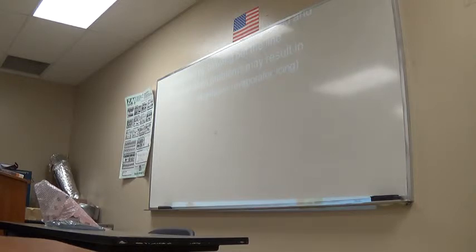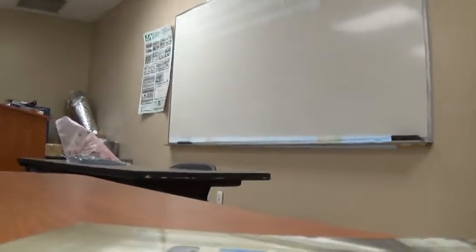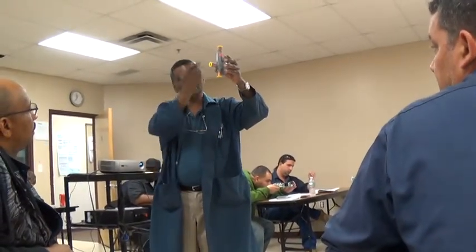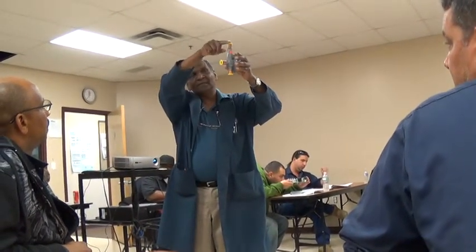O-R-O-A. I never showed you guys this, right? No, you didn't show us. And this here is a head pressure control valve. Remember when I had it like this? This was coming out of the condenser coil. This goes to the receiver. This goes to the discharge line. The other one comes in the side.